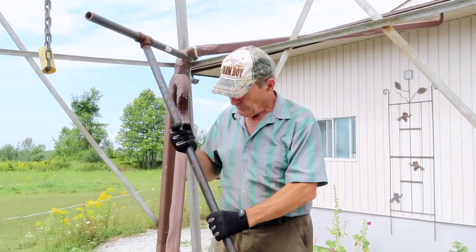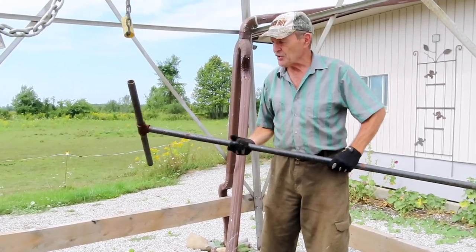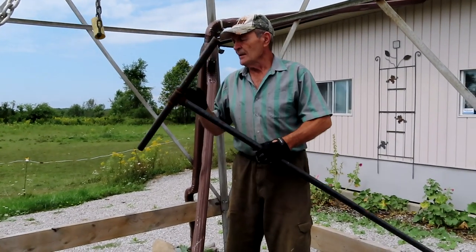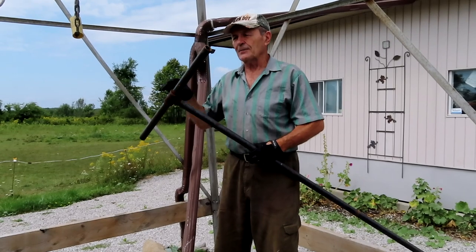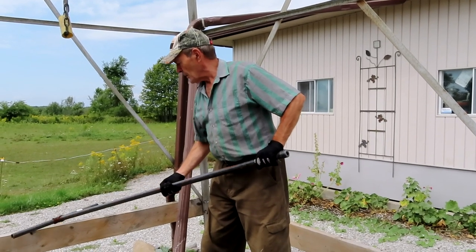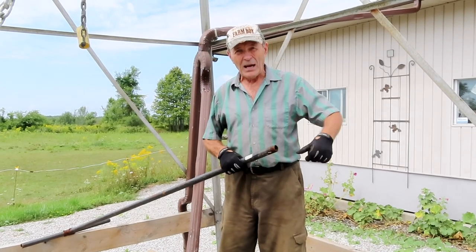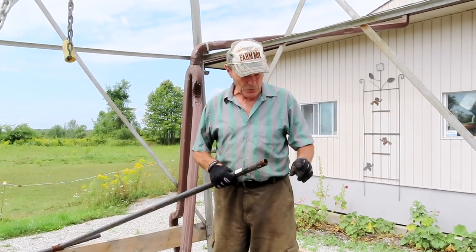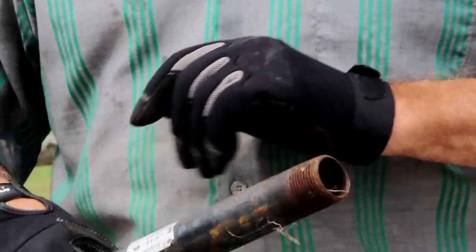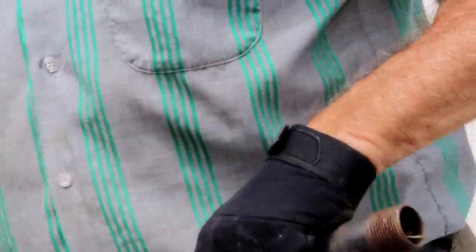What you need, very simply, is a piece of pipe. It has to be one-inch pipe. I put a T on the top like this — simplest thing in the world. Piece of one-inch pipe, six feet long, and on the top there's a T. I put a couple of handles on there for a little extra leverage. Just that simple — it's all you need to pull your pitless adapter. So next time your pump has a problem, don't waste your money calling a pump guy. Make one of these — $20. On the bottom it has a good clean one-inch thread. Keep that covered with a plastic cap or tape to keep it nice and clean.